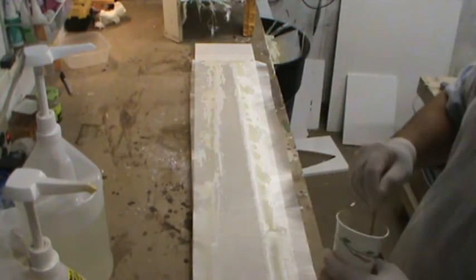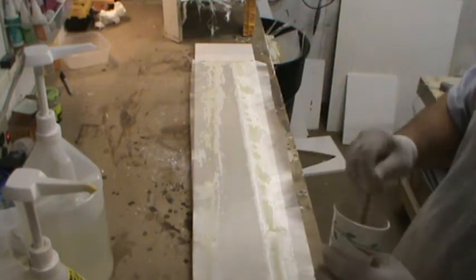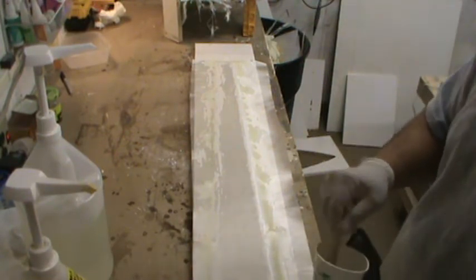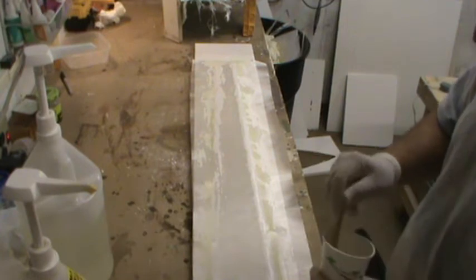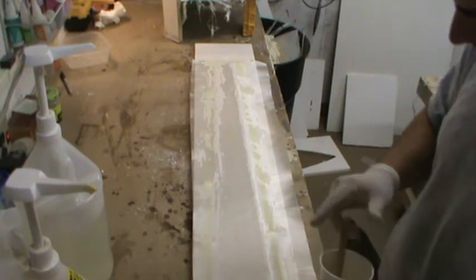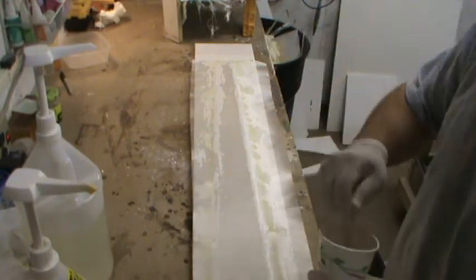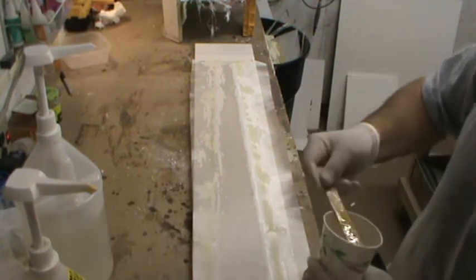And the plan is I'm going to get both of these molds completed today or tonight. I'm going to wake up in the morning, demold the nose cone and this flap mold, wax and PVA the other half of the flap mold, and get the other flap in the parting plane and waxed and PVA'd. And hopefully I will be able to lay up the second half of this flap mold, the first half of the other flap, and the canopy vacuum form plug all tomorrow. Whether or not that happens, we'll see, but that's what I'm hoping to get done.